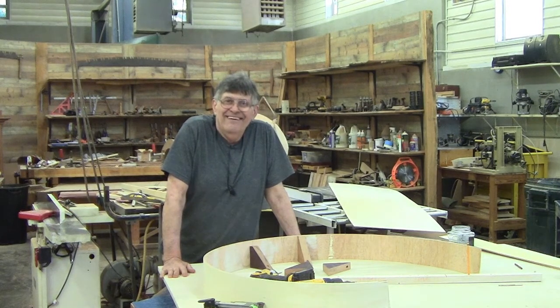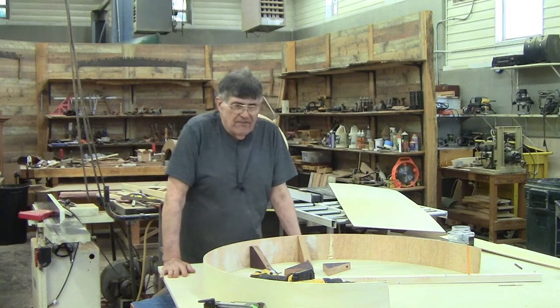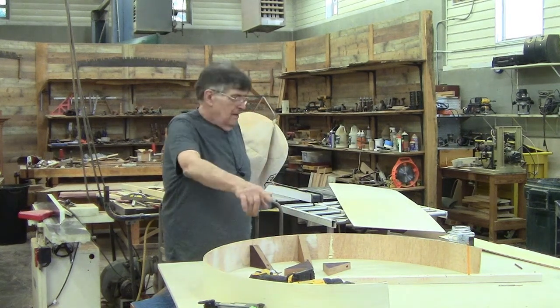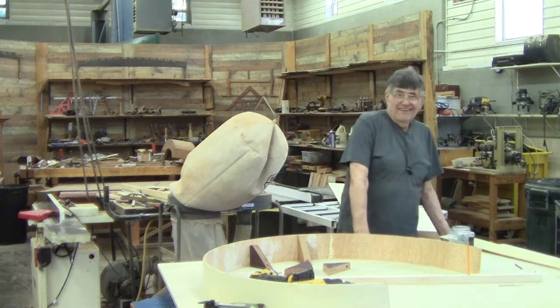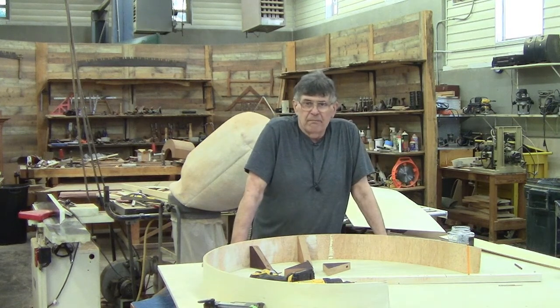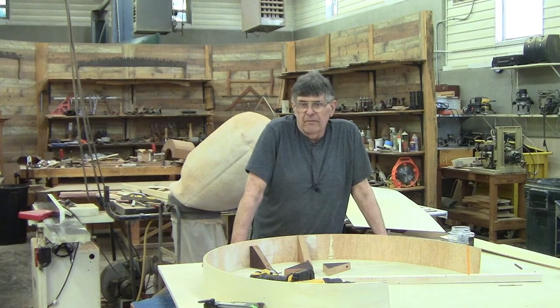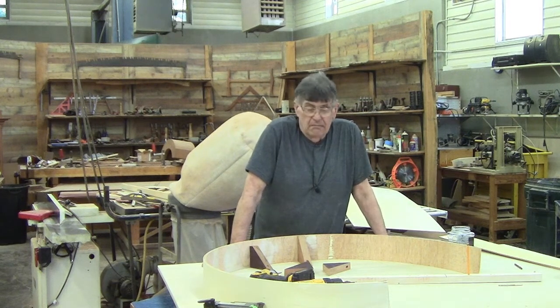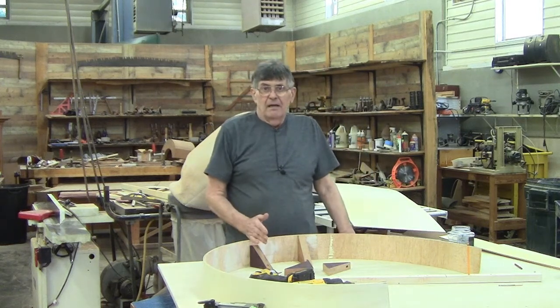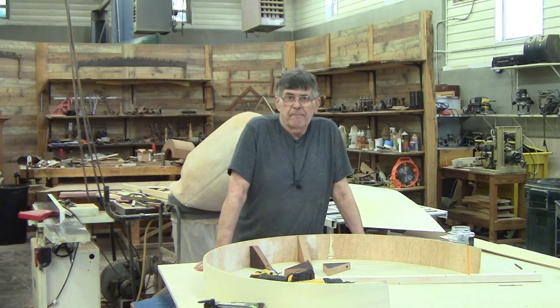I like that. I think it'll be good. I mean, in as much as cutting these tops, this 5 foot right there is the corner. And over here is the other corner. Yeah. And this way I don't have to make patterns. I don't have to glue up plywood to get 5 foot and all that stuff. Because in as much as cutting the tabletops, which we'll film, we're just going to use a plunge router and a little jig and we'll use an upcut spiral bit. Because we'll be indexing from the bottom, and we want a nice clean edge. So upcut is going to give us a clean edge on the bottom, which will be our top. Right?